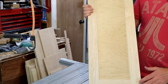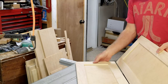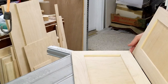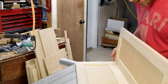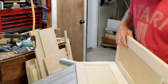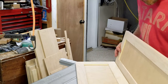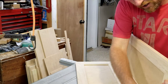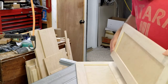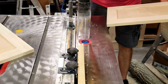Now what we have here is a corner cabinet door. You only want to chamfer the outside of the fold. These doors work by coming together and bisecting each other — you don't want a decorative edge where the two doors meet because it just won't look right. So you do the decorative edge on three sides here. For a chamfer edge, doing it down the meeting side and on each panel would look silly. So I'll chamfer three of the best sides and leave the other one as a flat 90.